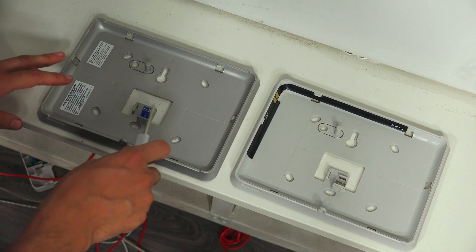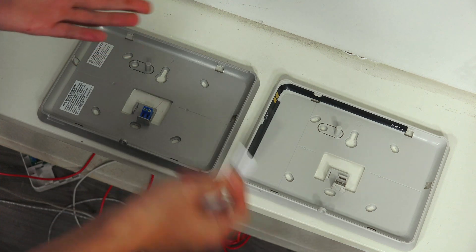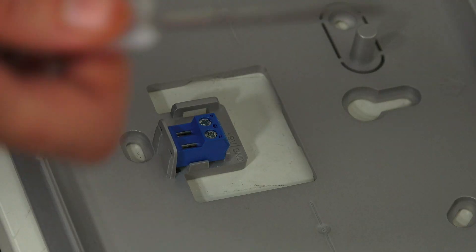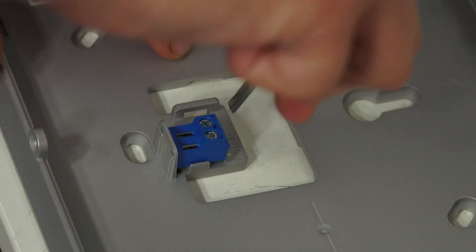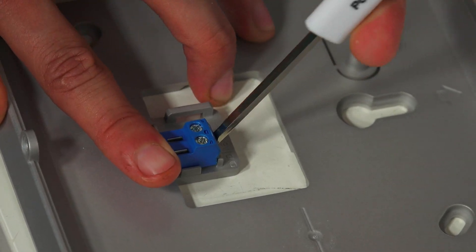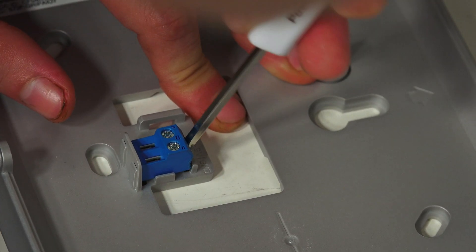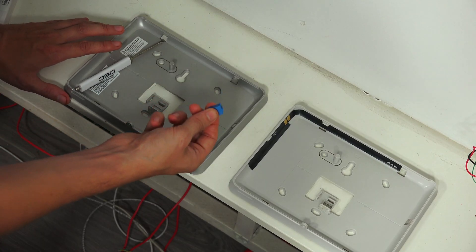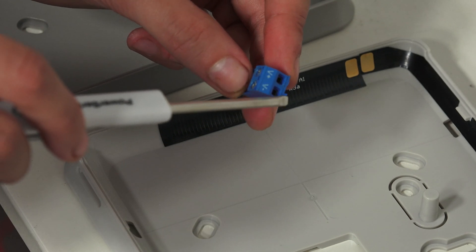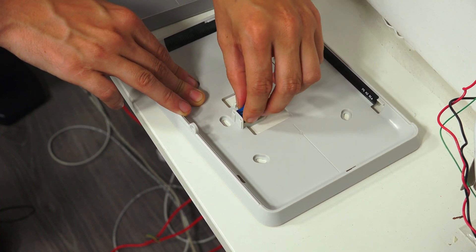If you have a Honeywell LT cable, you might leave the wires attached, but you definitely want to cut power to the terminal block when you do this. We have no wires attached so there's no power involved at all. To remove it, take a flathead screwdriver and pry it off — get in there and then pull it out once you get in far enough. Once you have it out, apply it to the Pro Takeover backplate, the one with the antenna. Get the little notch in there first so it locks into place. Once you hear the click, it's good.